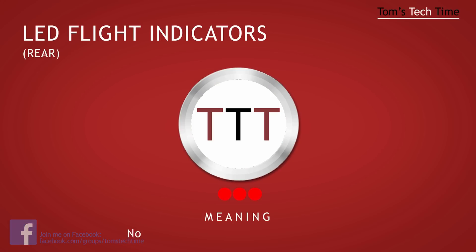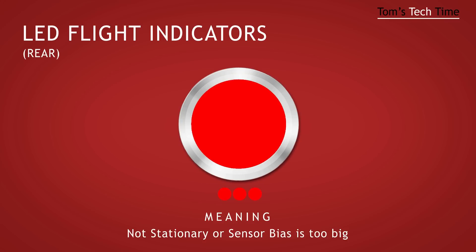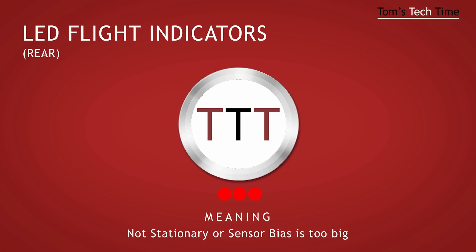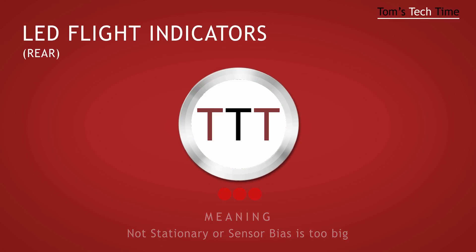Three red flashes show that we need to keep our copter stationary. Right now you can try to link it with your computer — start the assistant software, click on tools, and check the IMU calibration. You can do a basic or advanced calibration at that point. It's easy — maybe check out my channel, there might be a video uploaded on that.